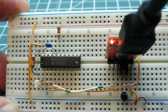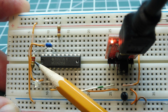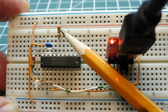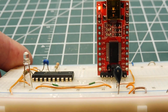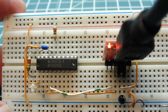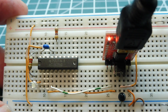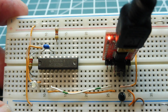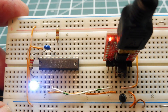I have my MSP430 microcontroller mounted on my breadboard using a low component count configuration. An LED is connected to one of the GPIO lines through a current limiting resistor, and I have a pull-up resistor and a capacitor for the reset circuitry. The microcontroller is powered at 3.3 volts via my FTDI USB-to-serial module. The UART of the microcontroller is also connected to the FTDI module, so I can access the microcontroller through the serial port and control the LED — making it blink or turning it off.